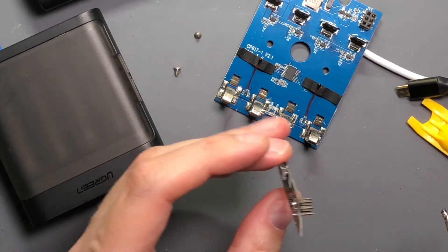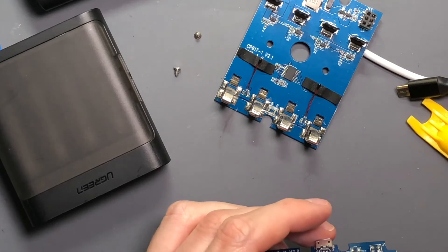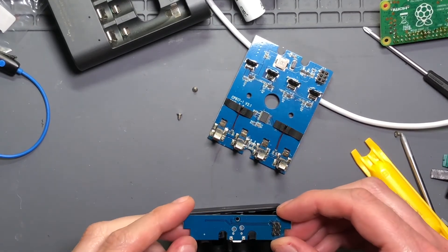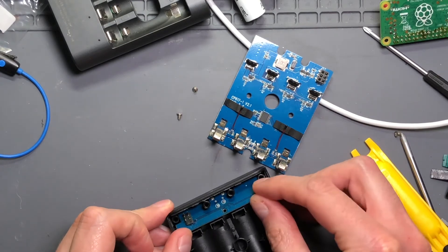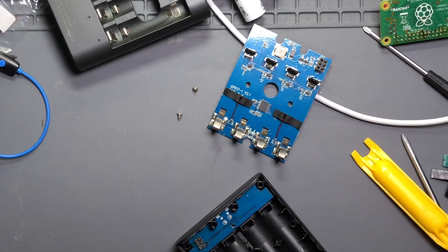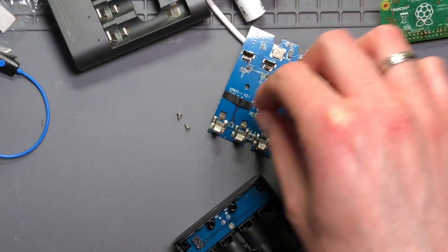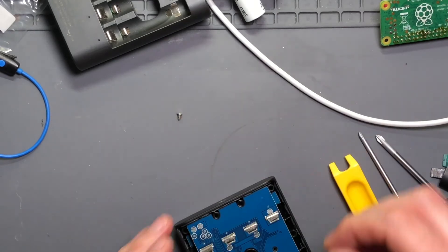Wow, that really did work. It might be a little too far and I might have weakened the mechanical structure in the back because there's not a lot of pin left on the other side of the board — I recognize that. That's finished. Let's flip this around. The micro USB port sits in the front there, and we have one screw holding that in. These screws are not the best — they're not holding it especially well. I'll push this back down in there. That definitely fits snugly.